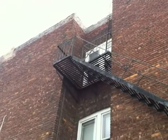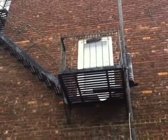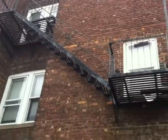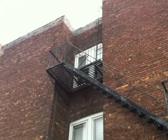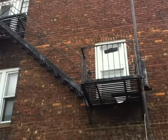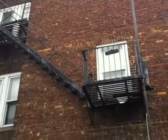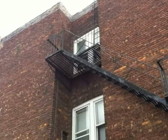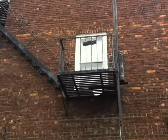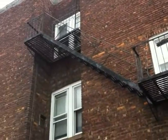So again, because this fire escape has never been refurbished, you're looking at least 75% refurbishment on this fire escape, and it needs a full paint job. Now, this fire escape is older than 1978, so it must be handled by somebody with a renovator's license, because it does have lead. That is a general contractor that has gone to an EPA course and understands that you cannot weld on this fire escape, you can only change bolts. So no welding of any kind on this fire escape. It's an occupied building with children. Can't weld on a fire escape that has lead.